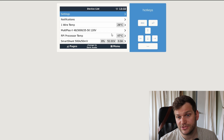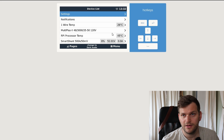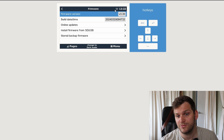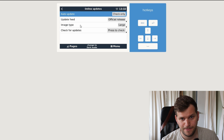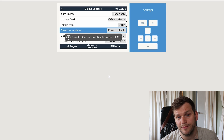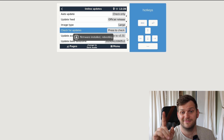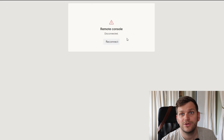I have to interrupt — the first time it stopped at 53% and just rebooted. The second time it said install 100% but didn't say reboot, then it did reboot. I can see Node-RED is not working and it's still showing version 3.30. I'm wondering if my power supply might have some issues, but I'll do it a third time. I'm watching what it's doing at 99% until it gets to 100%. Firmware installed, rebooting — that's a good sign. The third time is a charm. Fingers crossed it comes back up.